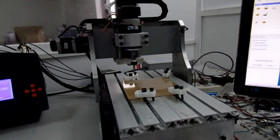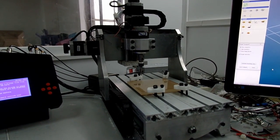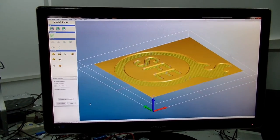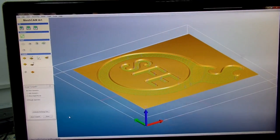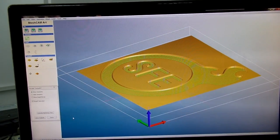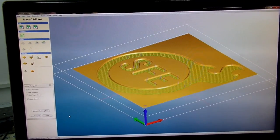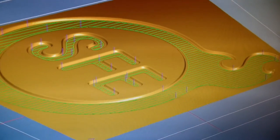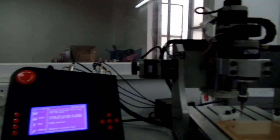And it's hooked up to just a cheap CNC machine we bought off the internet at the moment for testing with, and I'm using MeshCAM software to generate patterns for it, to generate the G-code. You can see here I've used the SparkFun logo because it's simpler than the DAGU logo, just quicker and easier to use. I've already loaded that tool path. You can see the tool path there. I've loaded that into the SD card on the controller here.